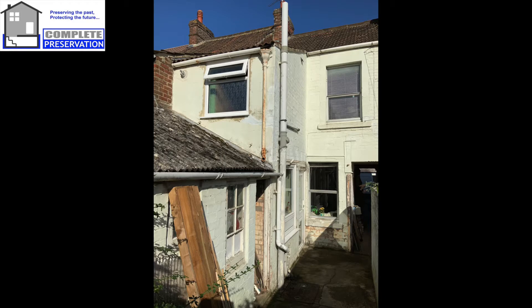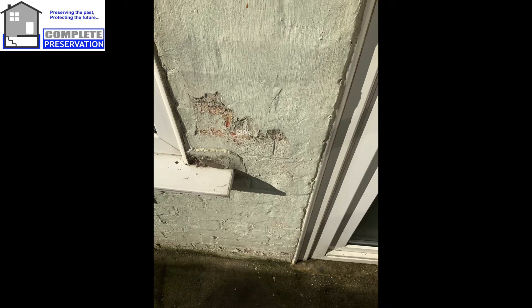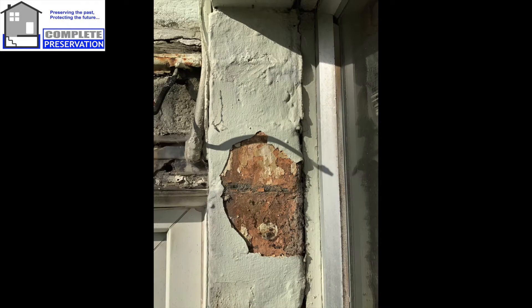Here you can see you've got rust and rainwater goods, a lot of masonry paint that's cracked, there's a timbered-in area here and a poorly installed window, and there's lots of bubbling, blistered paint trapping in lots of moisture at high level and low level.